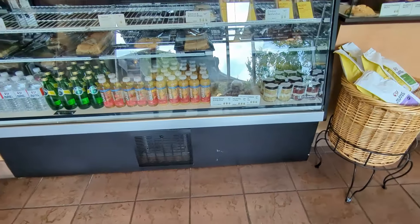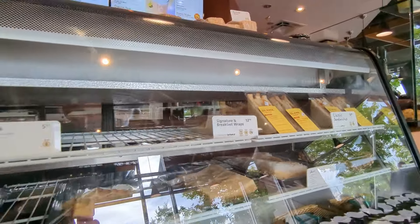We checked out a little display cooler at a coffee shop. It was completely frozen over. It's one of those DX coils, so it doesn't have a fan to force the air down - by gravity it cools the coil and takes the cool air down. Anyway, it was completely plugged up with ice. So we just made an adjustment to the thermostat controller to increase the intervals and length of the defrosts. Before, she only had it going into defrost twice a day for 20 minutes, and that just wasn't enough to thaw the ice that builds up over the day. It just keeps building and building until suddenly it's frozen solid and doesn't cool anymore. So we adjusted those defrost intervals and that should take care of that.